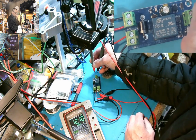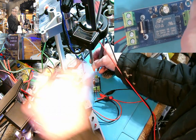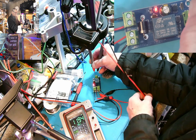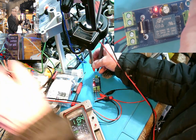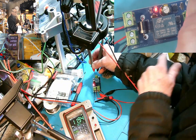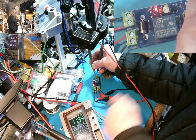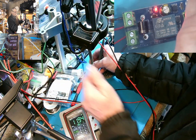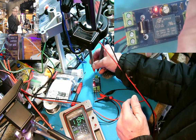We hook up this and we're getting 12.10. So we plug in the main power — the main power comes back on and we drop down to 11.94. There's just resistance in the leads. I was thinking that one would be 12 and one would be 12.15, but it's a little less, and I should have expected that going in.